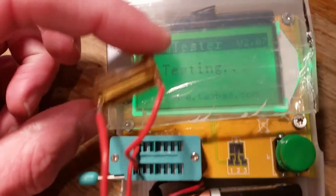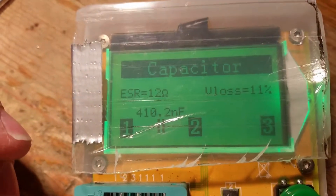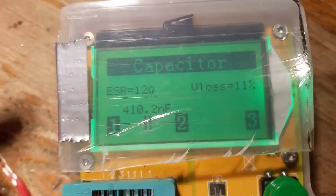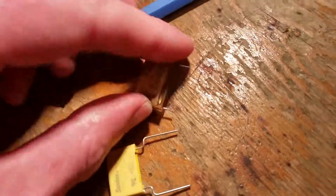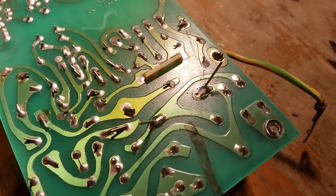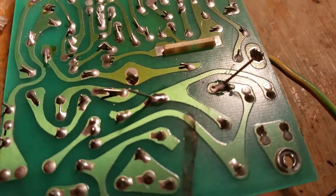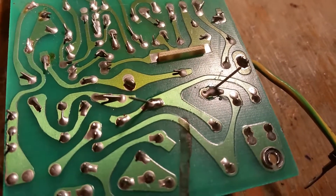Capacitor 2 is this one - so why it's not working. This is the original capacitor. It started to fracture along the side there. It should be 100 nanofarads - it's 410. It's got 11% voltage loss on it, so that's probably not helping. Mess around with it a little bit to get the pin pitch the same. Seeing as it doesn't matter which way around. It doesn't look shiny - I've been at it three times. I think it's because the heat sink is so big - I'll have one more go to try and get it shiny, but that's pretty much on.